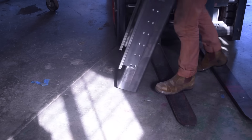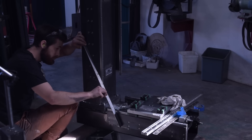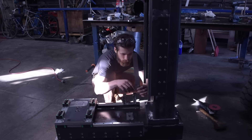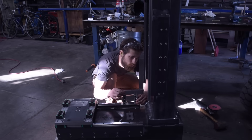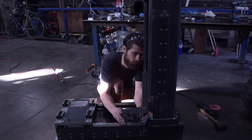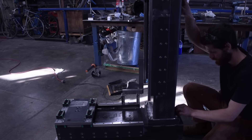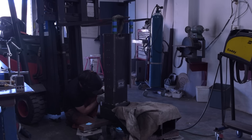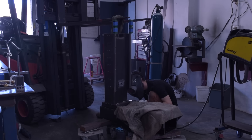Once I'd repeated the drilling, tapping, gluing, and machining on the column, I could weld on the base plate. Using shims and tactical tacking, as square to the y-axis as I could get it, I welded the column in position. When it's time for the final assembly, I'll epoxy the mating surfaces and true the column with the three jack screws on the base plate.